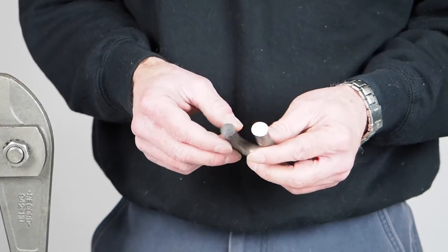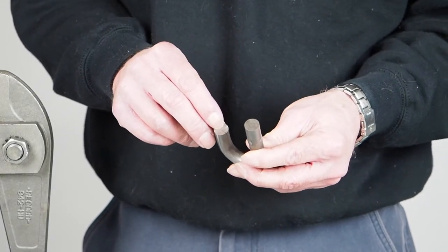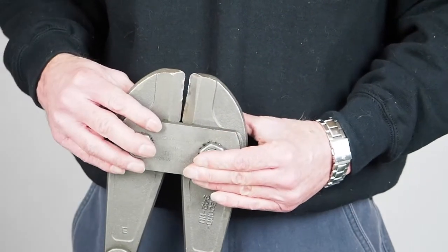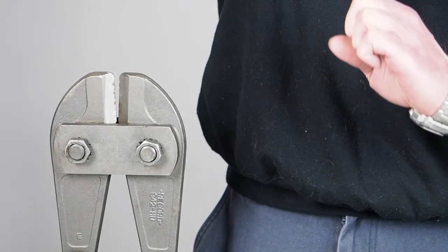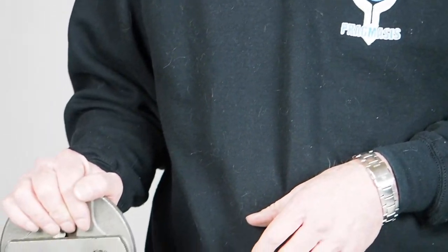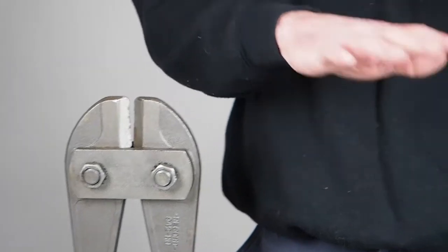We case harden all our chains, but that is a simplification. Case hardening is easy, but a fully soft core is also going to be weak in tension. We need a hard case in order to stop the hacksaws, but we need to do more than that. Many people don't realise that a bolt cropper attack often results in a tensile failure due to the wedging action of the jaws being brought together — the chain is actually being stretched and that's how it can fail. So if we're going to stop bolt croppers, we need tensile strength in addition to that hard case. We also need some solidity to give support to the case, or it could be like just thin ice on the surface of a pond.